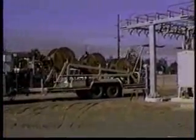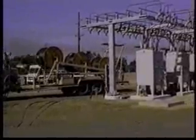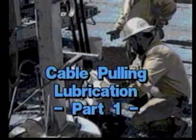While cable pulling is a decades-old installation method, improvements in cable pulling products and techniques are ongoing. Modern pulling lubricants and lubrication procedures can produce friction coefficients of 0.1 or lower, which reduces pulling tension substantially. Not only does this mean easier pulls, but longer pulls with fewer splices and less chance for cable damage both short and long term. To show the field side of lubrication technology, American Polywater is pleased to present Cable Pulling Lubrication Part 1.